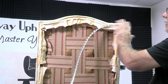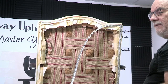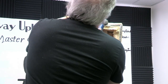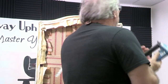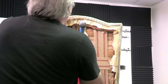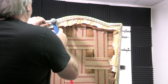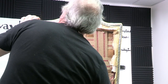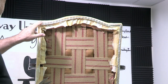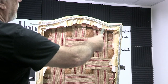The idea here with the ply grip is to get it as tight and clean as possible, because that is a point where people will brush up against — it's a stress point in the chair, especially with very thin fabric. You want to try to finish it properly. The nice thing about ply grip — look how flexible it is. You don't want to go too far ahead, but if you're really skilled you go three or four inches ahead, get a staple, then swing that around.